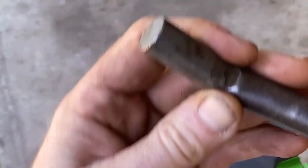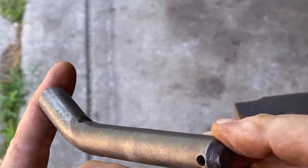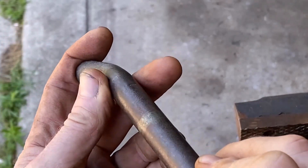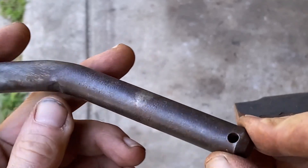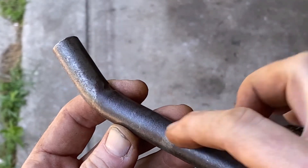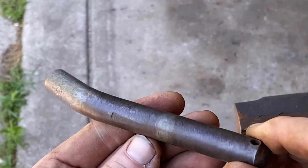Look at that pin — show me the rust on this pin. You can hit this with just paint now. I'll give it at least 24 hours before you put it on. But I'm going to hit it with etching primer because I want it to etch to the metal. I don't want to do this and spray it down and then it starts getting scratches and getting banged up again within a year.